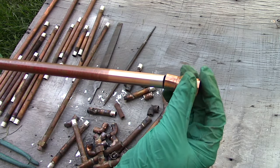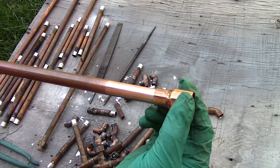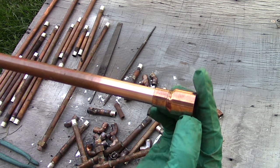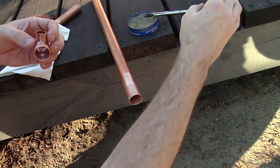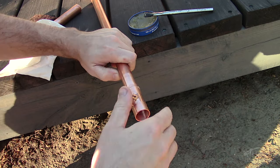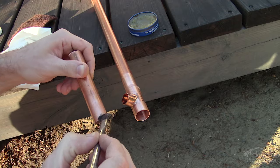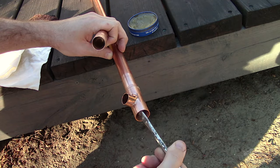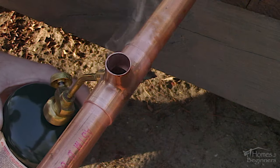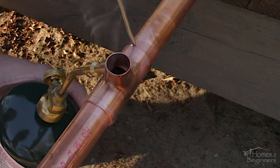While I'm not showing this on here, internal cleaning would have a similar procedure, but it's a little more work intensive and time consuming. A file isn't recommended as it's harder to use — you'll have to roll a piece of sandpaper instead and twist it inside the soldering surface. A round wire brush is sometimes hard enough to pull out the solder too. When done and those connections are cleaned, they're ready for solder. Any leftover solder on the surface will liquefy and flow back into the joint with the new solder.